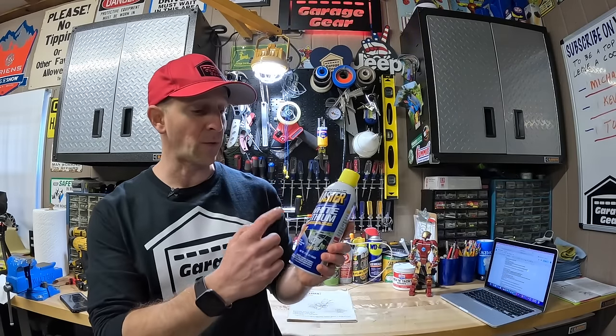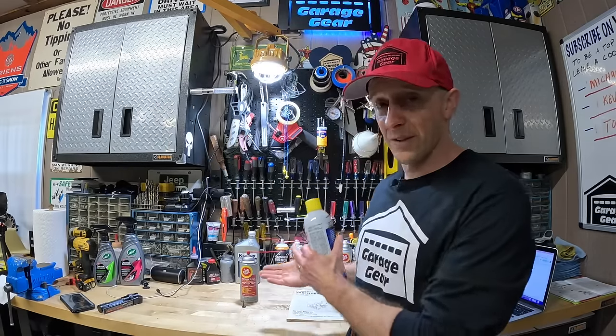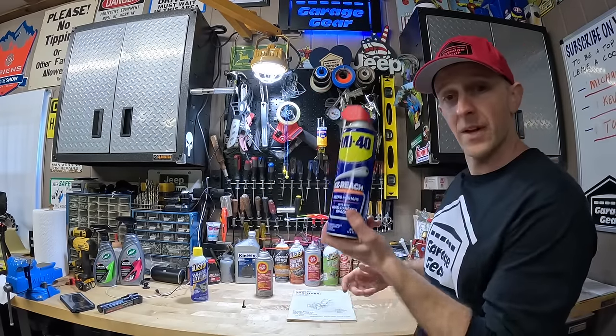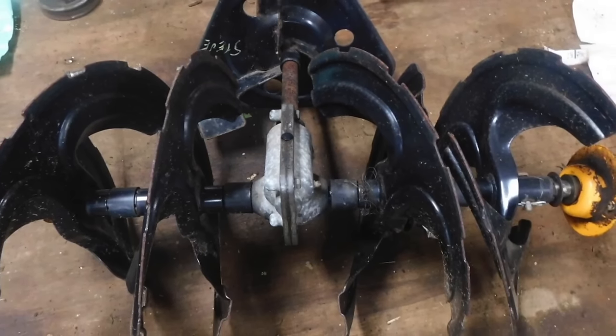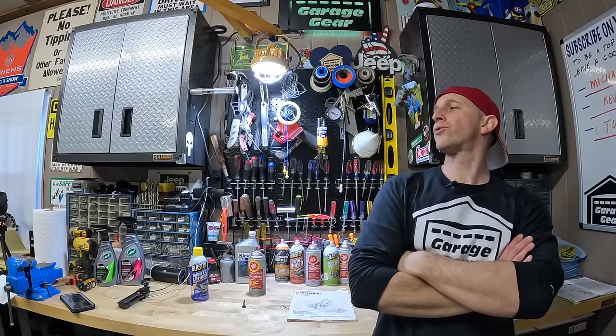Can you use red and tacky grease or white lithium grease in a sprayable can? Yes, but those don't really flow into tight spaces as well as Fluid Film does. In my experience, Fluid Film seems to get in better. What about WD-40? WD-40 is good, but it's thinner and washes out quick, so you're better off using something that's going to stick around longer. Another thing you could try is to fully dismantle the entire front auger assembly, pull it apart piece by piece, and grease everything heavily with red and tacky grease. But that whole procedure is extremely time consuming. After doing this quick spray procedure once a season, I have never seen an auger seize on these.